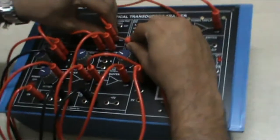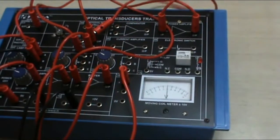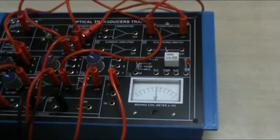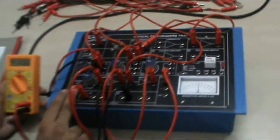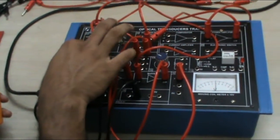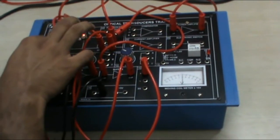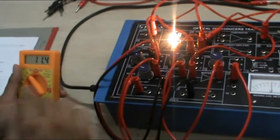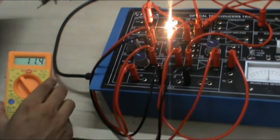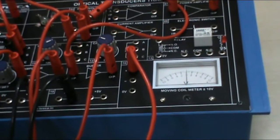The B point of this wire wound pot is to be first connected to the output of the photo transistor and then to the input of the power amplifier. Now as we switch on our system after completing all connections, as we increase the wire wound pot, the voltage will increase with an increasing pace which will be approximately 11V as you can see in the DMM — like this graph from 0 to approximately 10 to 11V. That's it in the fourth experiment.